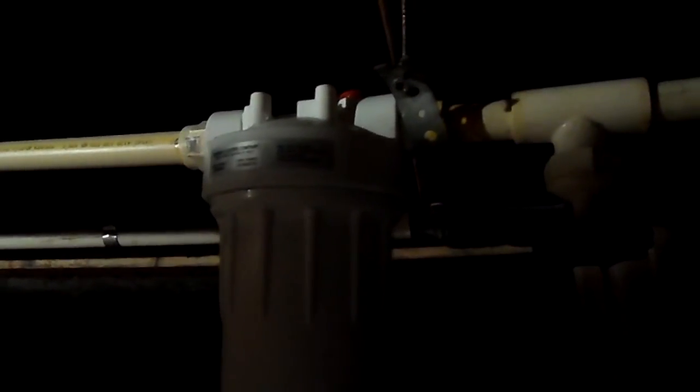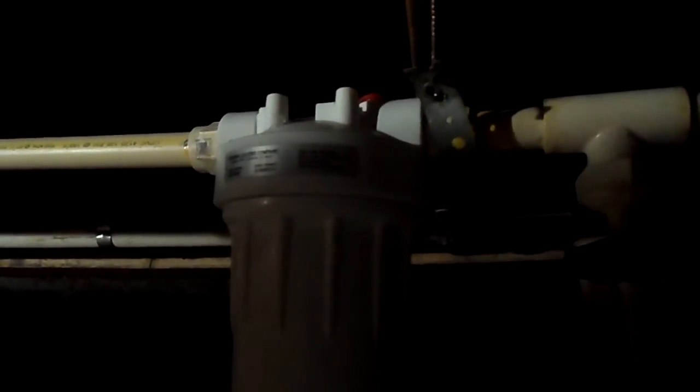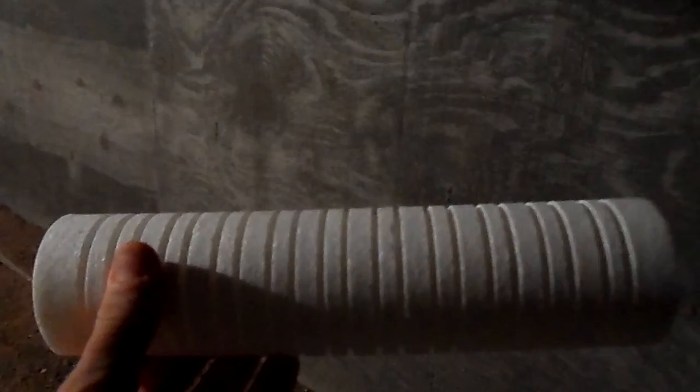Now you're back to filtering the water, removing all sediment smaller than ten microns, five microns, or even as little as one micron. A one-micron pleated filter is what I tend to use — it works better than non-pleated filters because it increases the surface area and the filter lasts a little longer. Make sure to replace your filter once every three to six months at least, as per the rating of the filter and depending on the amount of water that you use.